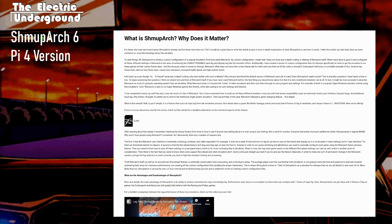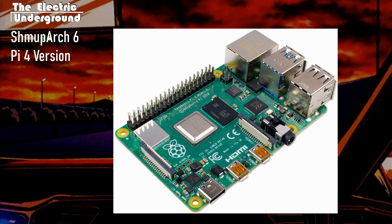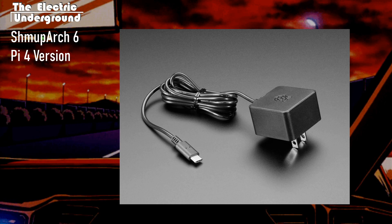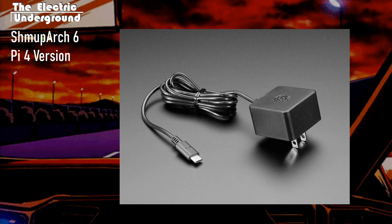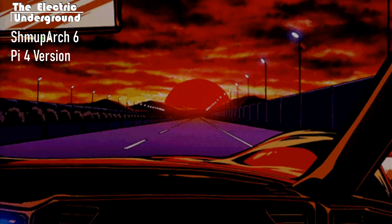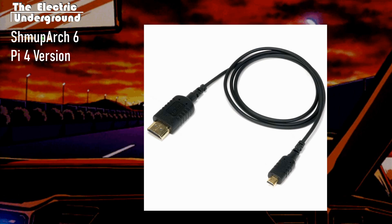So let's talk about how we get started. The first thing you need to do is get a Raspberry Pi 4. You cannot get older models because you need the power. Here it is — that's what it looks like. You also need to buy a specific power supply. There is a recommended power supply you can get from Adafruit and similar places. I'm personally using my Nintendo Switch power supply — I have no idea how damaging or effective that is, but it seems to give enough power and hasn't had any negative effects so far.